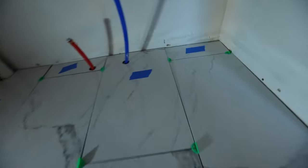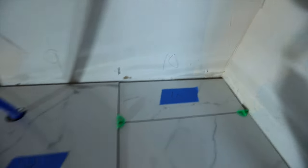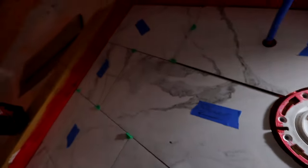Everything is cut and ready to be put down. Don't forget to label your tiles — the ones you cut — because some might look a lot like others and you'll get confused. If you put one down wrong, you're not going to be happy. I marked all around the wall: this tile says 10, the wall says 10, and for the tiles around the toilet flange I noted which direction the shower is. If you don't have to think about placement, you can go a lot faster. Laying tile is a different thing than cutting and planning — that'll be a separate video.